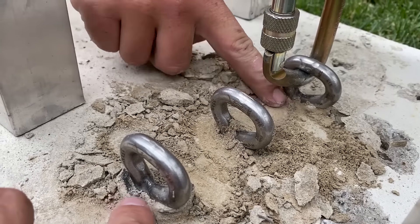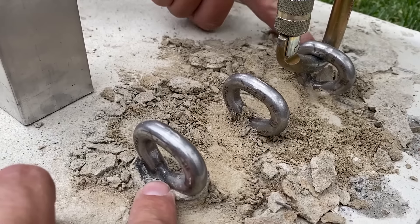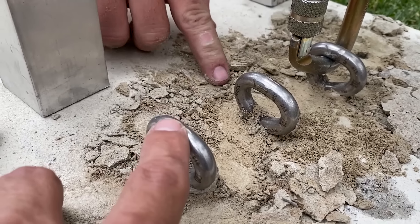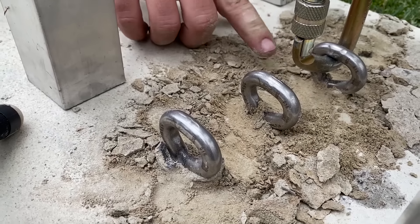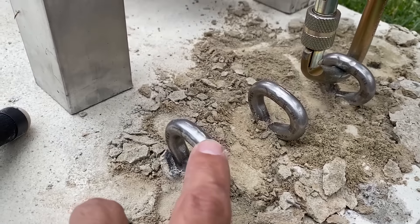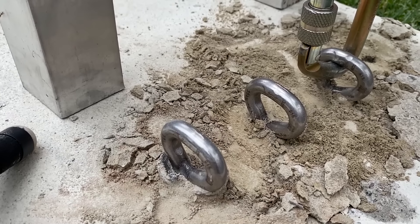In theory this should pull out the glue, and if it doesn't, that means we're getting full strength. These have threaded rods on them which means there's great engagement with the glue and they should not come off the glue. Stainless steel does not stick to epoxy very well.